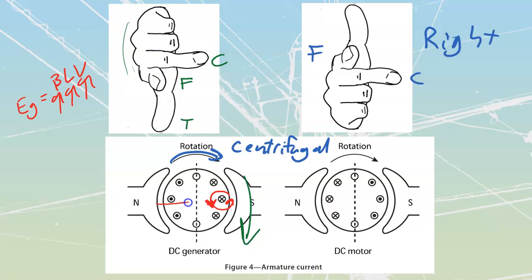I'm going to fire a line of flux through from here. When that line of flux catches into here, I'm going to see that it's going to get caught and ripped around like that. Well, if I take a look at this, which direction am I stretching this magnetic line of flux? I'm stretching it down. So it's going to give me a repulsive force that is going to try to fire this conductor back up and out of here.